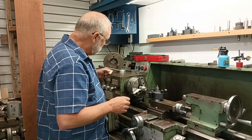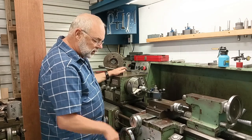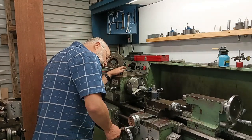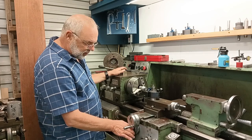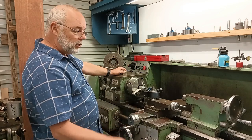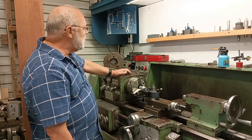There are a few other interesting things about this machine. The carriage handwheel has no calibrations on the handle itself, but there's a dial down here that is graduated — it's gear-driven through a mechanism. One turn equals 18 millimetres and you can zero the dial. All in all, for three thousand dollars, this machine will do a pretty big cut. I've taken four, five, six millimetre cuts with this — the chips will fly out, no problem.